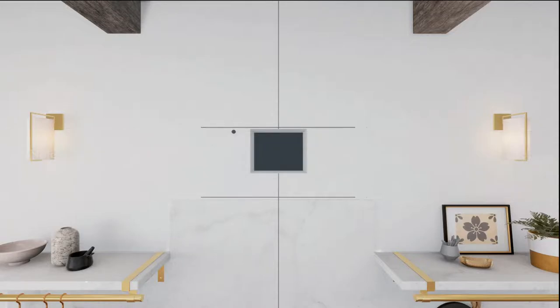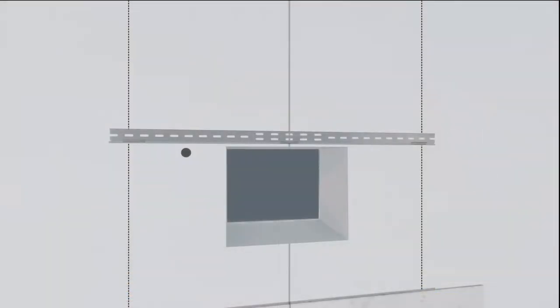To install the installation bar for back wall venting, locate a minimum of two vertical studs by tapping drywall with a hammer or using a stud finder. Center the installation bar left to right above the marked line, hold the bar against the wall, drill 1/8-inch pilot holes through the drywall and into the two vertical studs, then secure the installation bar to the studs with the supplied screws.